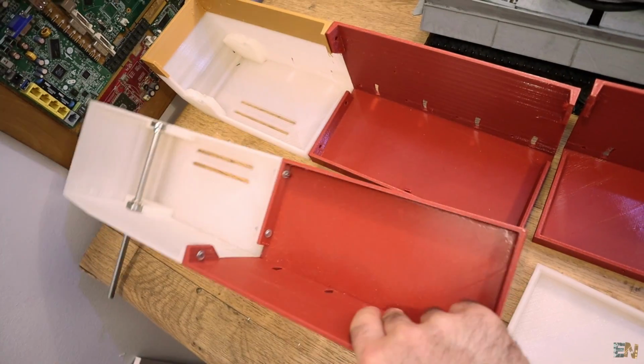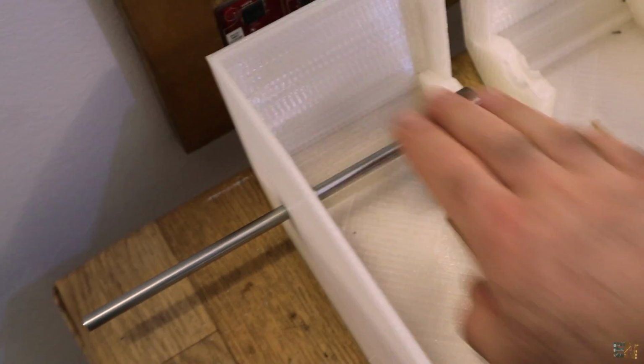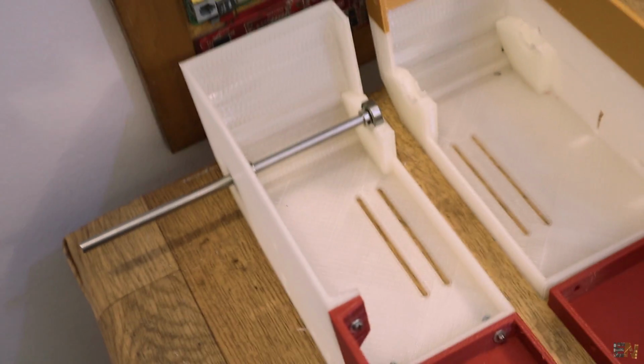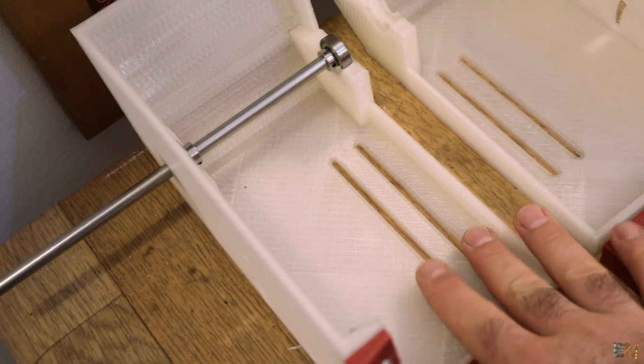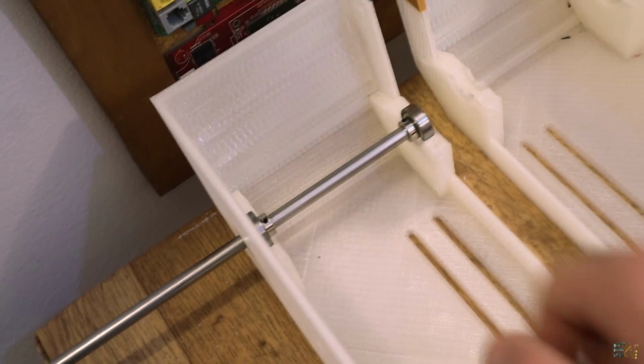As you can see, this one here. These two are screwed together with some screws, two here and one here. This shaft here is the one that will spin the gear wheel, and that gear will apply the force to the entire track. And here we'll place the motors. This, I think, will be a brushless motor connected with a pulley to this gear, so we have more force. And I'm also using some bearings for support.